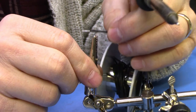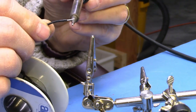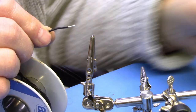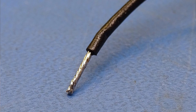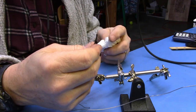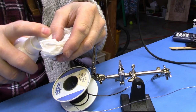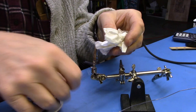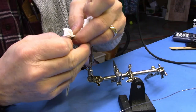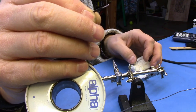Now because I don't want a lot of solder on this, what I will often do is get it nice and hot and give it a little flick like that. Now you can see there's very little solder — you can actually see the strands of the wire, but it is completely impregnated with solder. Lastly, we're going to take this and clean it with some isopropyl alcohol. I take my paper towel, put a little bit of 99% isopropyl alcohol on it, and clean that off so I have a nice beautiful tinning job on my wire, nice and clean and ready to be put wherever I need to put it.